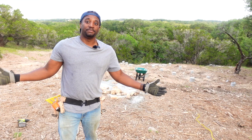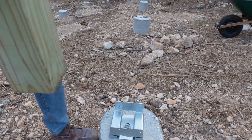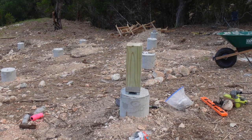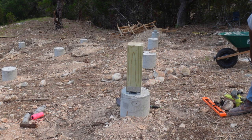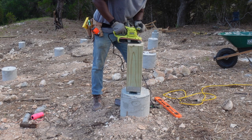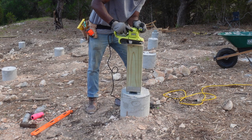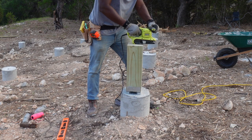The first post was sitting just a little bit out of level because my miter saw was actually cutting out of square. So I grabbed my belt sander, which has 36 grit sandpaper on it. The lower the number, the rougher the feel on the wood — this 36 grit is acting like a planer, taking off a lot of material very quickly. The key is to make small passes at a time, exercise patience, and after a few tries, you get a level post.